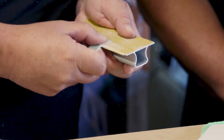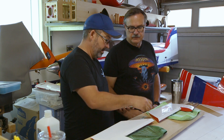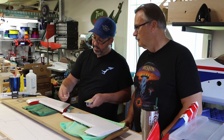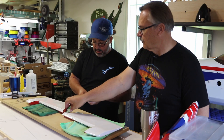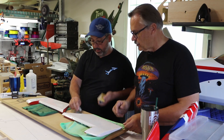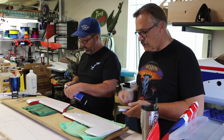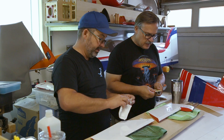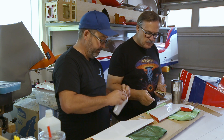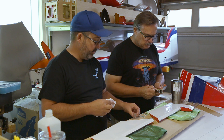Give the glue something to hold on to. Double-check both sides. Do both of them — hold your finger along here so you don't sand the part that's hanging out. Then we go back to our isopropyl, or denatured alcohol since it's a little more aggressive for removing mold release. Some mold release won't remove with isopropyl alone. Acetone removes all mold release, and denatured removes a majority — about 90%. Denatured is also less flammable and not as bad for you.